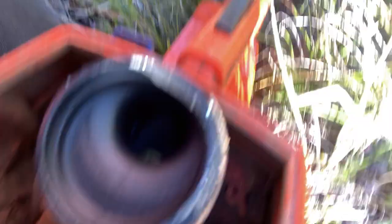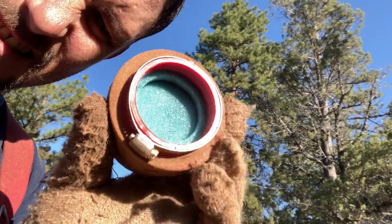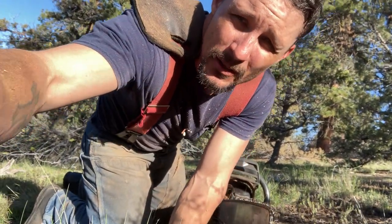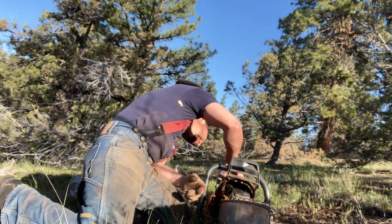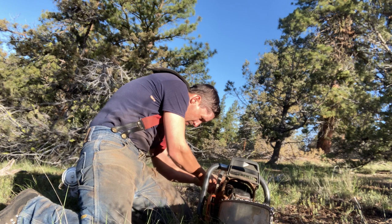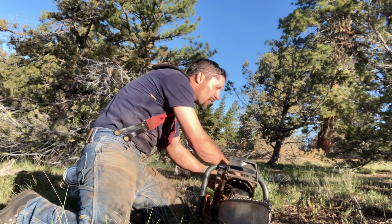You can see down in there — it's a nice smooth radius into the carburetor. It's a nice filter setup and it fits under the stock cover. You can also get taller ones — three inch or four inch, I'm not sure exactly — but for those you'd need to cut a hole in your top cover. Depending on the conditions you're cutting in that might be fine, but for me I think the one that fits under the stock cover should do just fine for now.